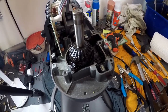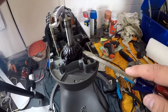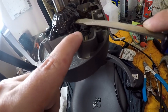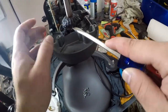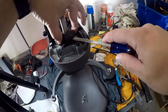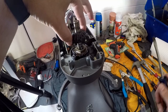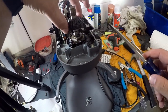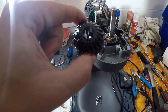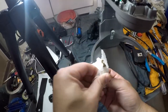The next step is removal of the bevel gear. We're going to get the flathead screwdriver. There is a gear here — the bevel gear — and underneath it is the worm follower gear. In between those there's just a little gap; you just want to wiggle this screwdriver in here. See, we get in and just start twisting, applying a little bit of upward pressure, and you'll see it start to break loose. Sometimes it can be a little tighter than usual — sometimes you have to work at it. Sometimes you have to get two screwdrivers and pry from both sides, but it should come right off. Now that we have the bevel gear removed, we'll place it back down with the rest of our gears.